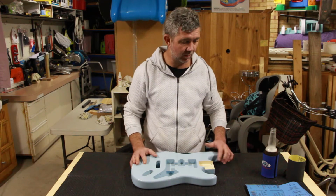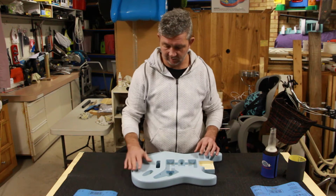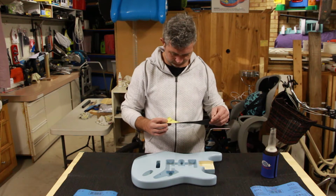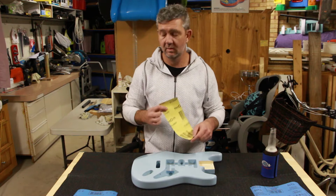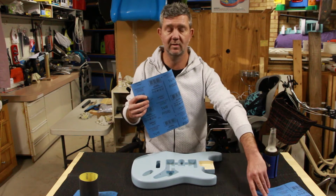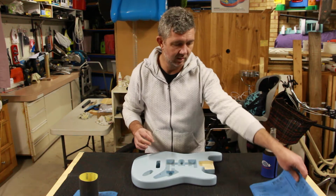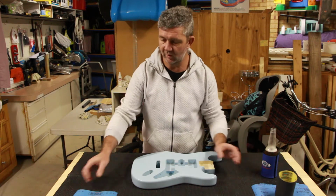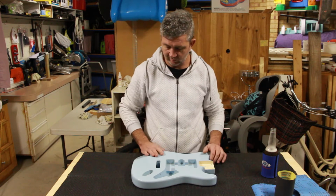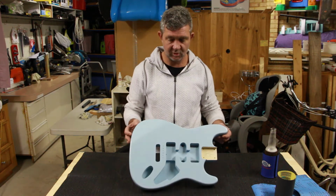So we'll start off with probably, I'll go with a bit of 800 there, get it nice and flat, and then I've got some 1200, maybe some 1200, then some 1500 and 2000 beyond that. So we've got plenty of options, but I'll start with the 800 to get it nice and smooth, and then we'll see how we go after that as to where I get with it, and then we'll polish it up, see if we can't get this thing to a lovely mirror shine.